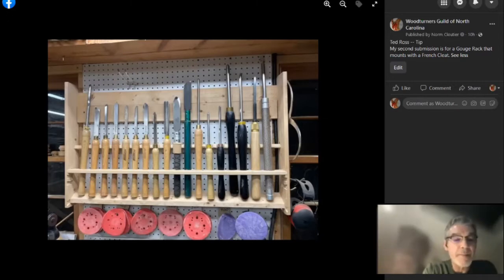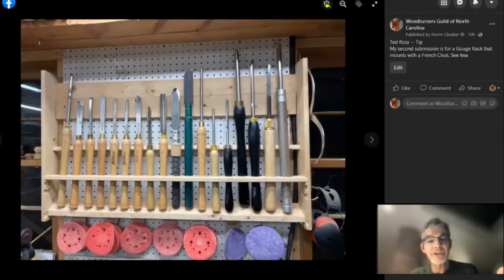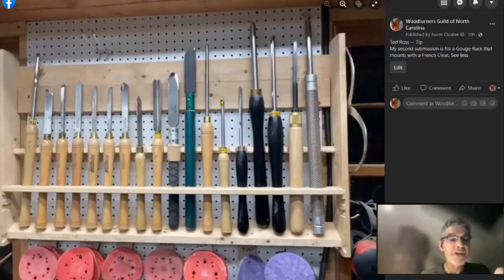And what I did is that bottom board you see on there where the butts of the gouges are is at a 30-degree angle. And then you can see where I got several slots on the next board up in there, and it's on the top slot there right now. I tried the bottom slot initially, and it wasn't enough to keep the gouge safely in position. Let's put it that way, right? If I bumped it or something, I was a little worried about popping back out again. And I ended up about 5 inches off the bottom of the gouge up is where that support board is. And then the next board up is behind all the gouges, and they just have round slots on them, okay, and on the back side.